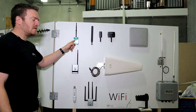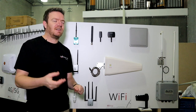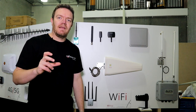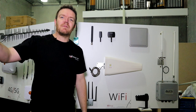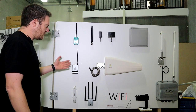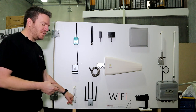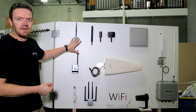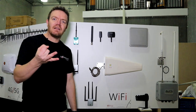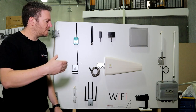You have devices like this which you can connect to a USB port in your computer or laptop to get a much better signal. The external antennas and the actual RF front end on the inside are exceptionally efficient and sensitive, so you can get much better range than just your standard Wi-Fi connection. Then there's the tube — the outdoor version of similar electronics. Basically you have indoor USB adapters and outdoor USB and Ethernet adapters, which you can use to create Wi-Fi bridges and wireless bridges.